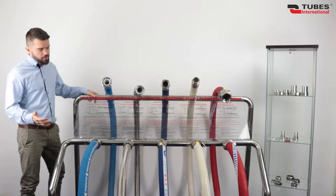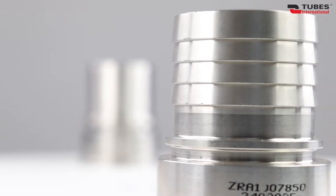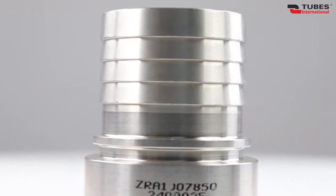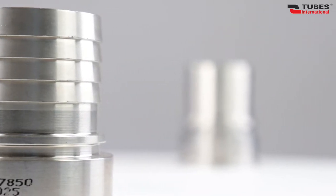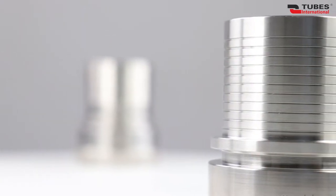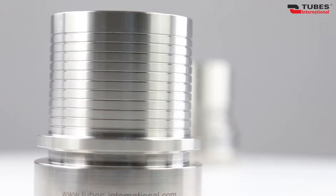I have prepared 5 hose assemblies with 5 different hygienic couplings. If the fitting of the coupling has a corrugated hose tail and is used on a rubber hose, then you can mount it with a safety clamp or crimp it with a ferrule, while for a smooth hose tail used on rubber and plastic hoses, use safety clamps.